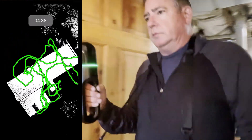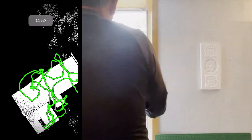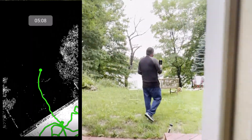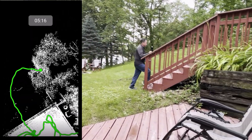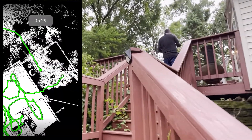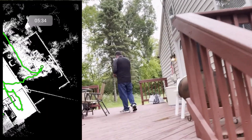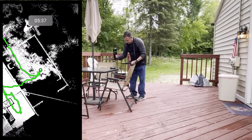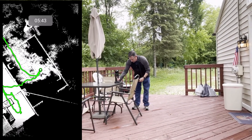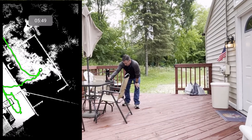I have now mapped the entire house. Rather than going back up the stairs and remapping that area again, I will choose to exit the basement door and go back up the stairs to the deck and the starting point. This will provide even more area to use for the cloud-to-cloud registration and a more balanced registration. I will stop the walk the same way that I did before — walk to the base, insert the scanner into the base, allow it 30 seconds to remap the area, and then a long press on the scanner button to end the walk. At that point, I will hold the scanner button again until it shuts off. Data collection is now done: 12 minutes, 8 seconds.